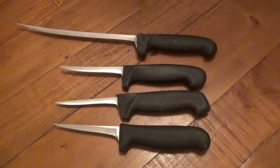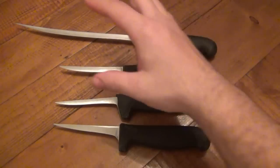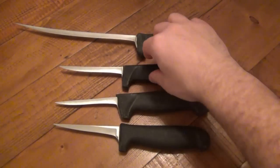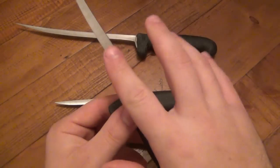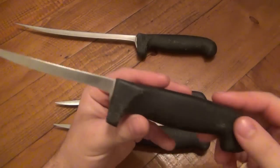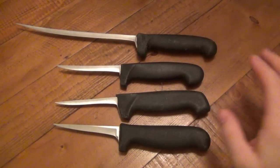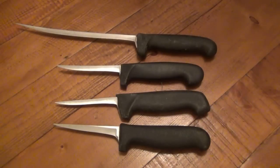It's completely different. In that case, sometimes your old-timey knives' blade shape is completely different than it originally was, and a lot of times it's ground down where it's a lot smaller. But that's years and years of use. This, although there's a couple years of use on these knives, should not be like this. In each sharpening situation, it was over-sharpening. There is such a thing, obviously, as taking off way more steel than is necessary.